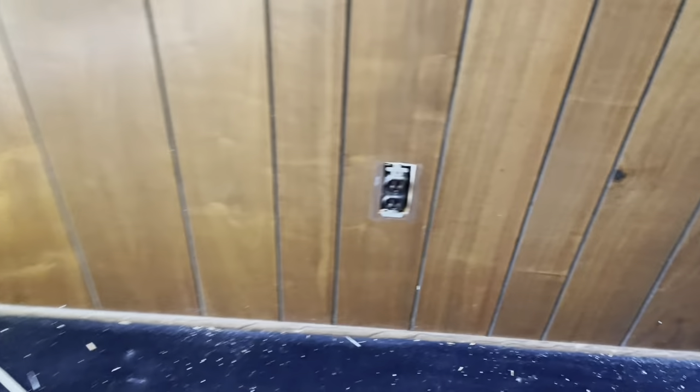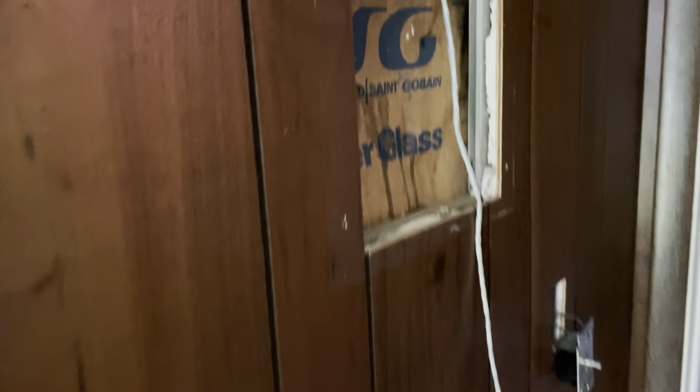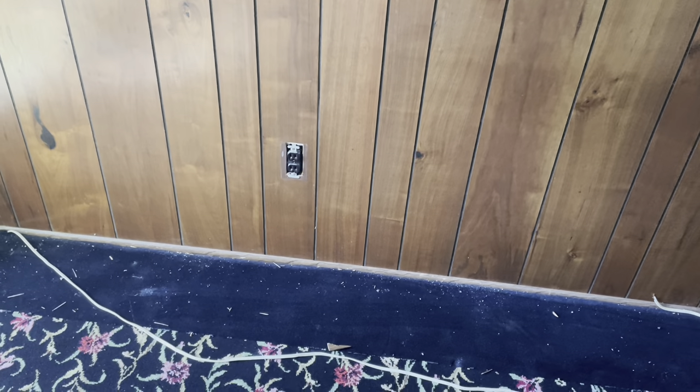So I'm going to be removing this wall behind me. First thing you're going to want to do is remove all the covers for your outlets — you can see I did that here. I had an in-wall speaker thing too. I'm going to have to cut this with an all-purpose tool and slide my speaker through. There's moldings on the bottom and on top. I already removed the ones on top. Lots of times you can get away with just removing the top ones, and when you pull the siding off, the bottom ones just kind of leverage themselves out.